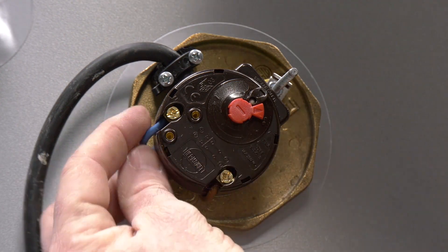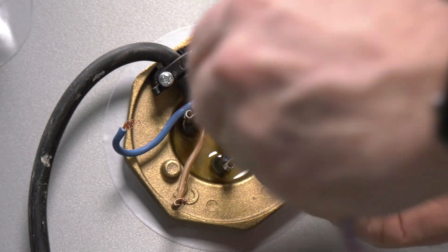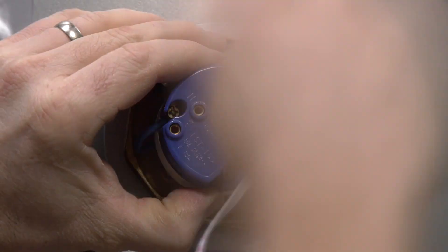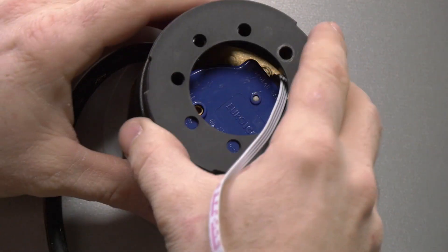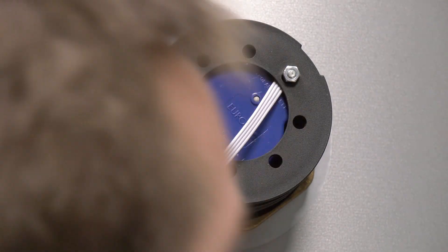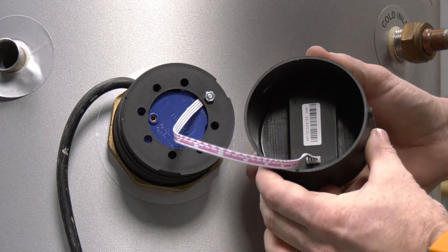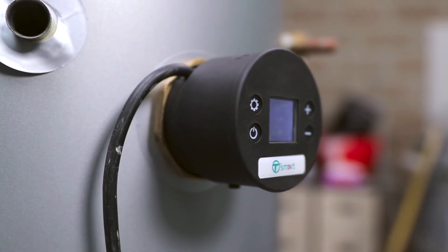Once that's done we can safely remove the terminals for the neutral and the live using a little screwdriver — should be able to just pull them out of the way. Then it's the task of pulling out the old thermostat and inserting the new Tesla T-Smart thermostat. When pushing the T-Smart stat back in, make sure you're careful with the control wire. All we need to do is reinstall our neutral and live wires, making sure they're nice and tight, before feeding the control wire through the new Tesla T-Smart spacer. Pop the stud through the multiple holes — there are loads of different positions to choose from, so this will fit on loads of different types of immersion heater. Lightly tighten up the nut, making sure that control wire is not pinched — it's got free movement so it won't get damaged. Then plug the control wire back in, line up the two arrows, push down and twist into position.